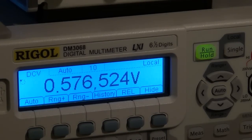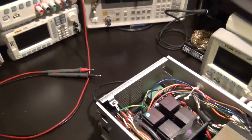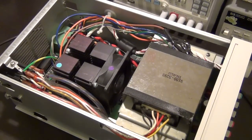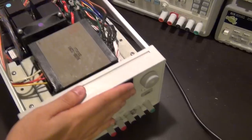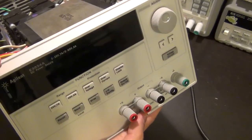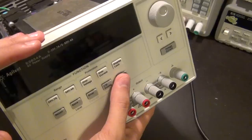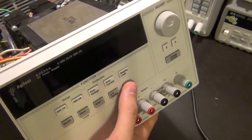This tells me the problem isn't simply the display — the problem is something more fundamental internally. Something we can do to point us in the right direction: all Agilent equipment and power supplies have a built-in self-test. To run it, you just hold the on/off button while powering the unit on. It will do a self-test and if it fails it'll give you an error code.